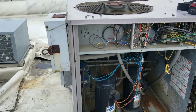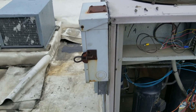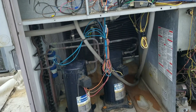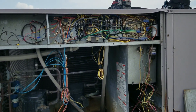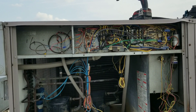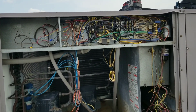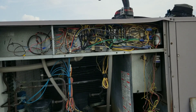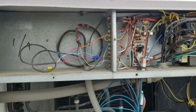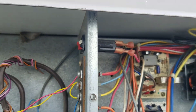I've got my front panel off and I haven't shut my disconnect off just yet — that's important because I don't want to disturb anything at this point. I don't know what's going on yet. If there were any fault codes flashing, they would be lost if I just turned it off and started pulling panels apart, then flipped it back on. Looks like I think I have already seen our issue — a little popper has tripped.